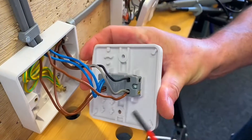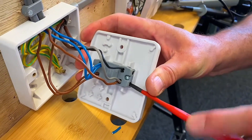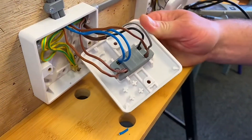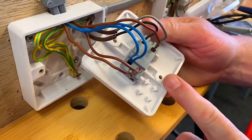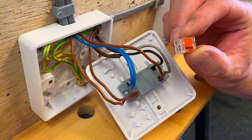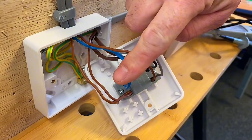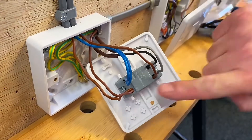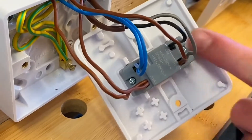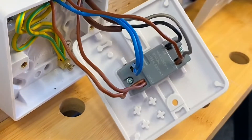The labels are a little bit different than we're used to seeing - we've seen L1 and L2. So there we have it. If you come across a switch like this - could be a Schneider one, could be a Hager one - where you've got the two neutrals for this system now connected inside the switch itself, we know that the neutral connection is not connected to any of the switching circuit. We've got L1 and L2 terminals and our common, so our connections have been made into this switch, replacing the original two-way switch.